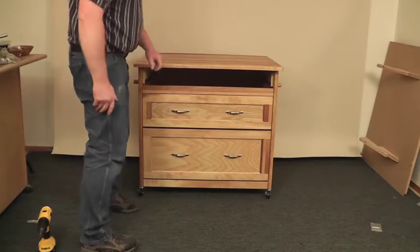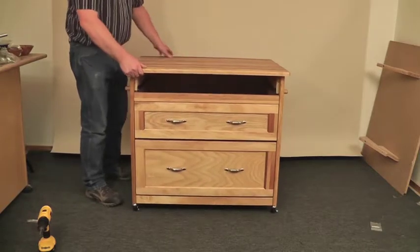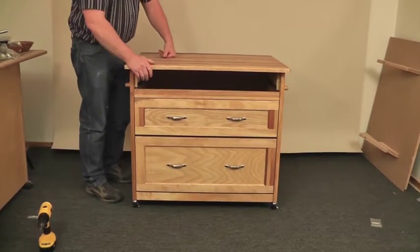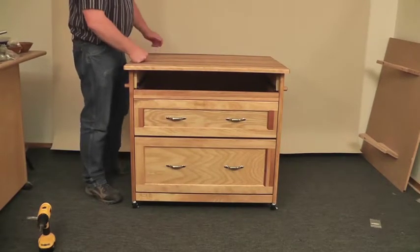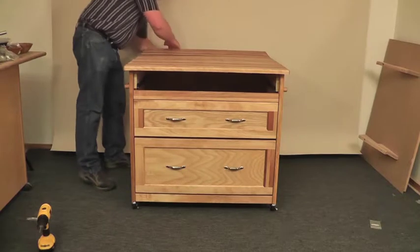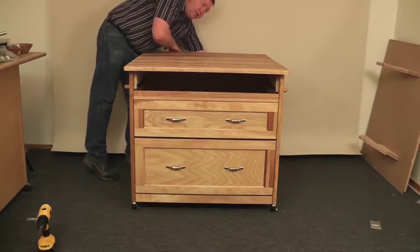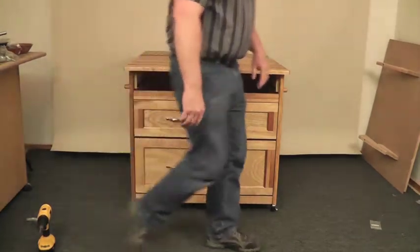Alright, now for the top drawer, it's important that we raise the drop leaf. Those metal drop leaf supports, when we first try to put the drawer in, they will catch the drawer while it's first going in. So if you extend it, install the drawer, then you can put them back down and you'll have no problem. So once the drawer's in, they're out of the way.